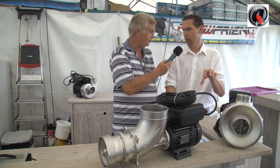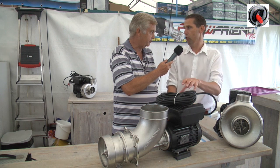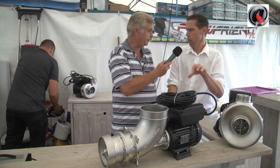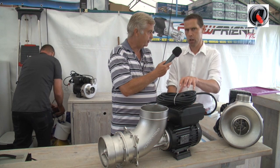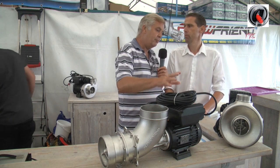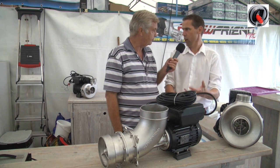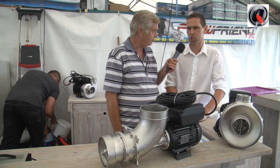We did a few adjustments. We added a pump with high pressure, so you can do more pressure, and we added a very low pressure pump for more flow. So you can now choose from 3 kinds of pump models: one with low flow and high pressure, one with medium flow, medium pressure, and one with very low pressure but extremely high flow for low energy costs. Of course, all three pumps have the same motor. What we changed is the front of the pump, so you get a different hydraulic for your pump, and actually a completely different system of how it works.